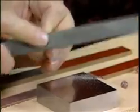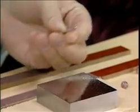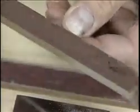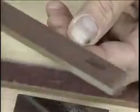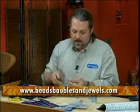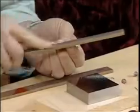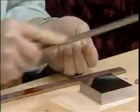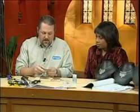And so once you have it shaped, filing is more for shaping. Right. You can start sanding, and I usually start with a 320 grit. It goes faster. It's a little harder to hold on to here. And is that to give it the high polish finish? Exactly. Now this is kind of the finishing stage of it. And you have to go through a successive progression of sanding grits. If you just start with a real fine 600 or so, it just takes so much longer to do. Absolutely. So we'll go there and then finish up with something like a 600. That really gives it that nice smoothness. Exactly. Especially since you're wearing something, you want it to be nice and smooth and soft. Exactly. Not have any edges to it.